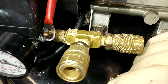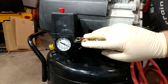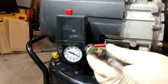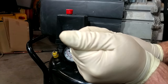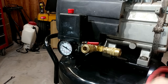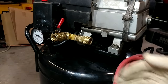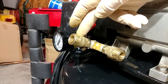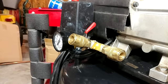If you really don't need two fittings, you don't need the T — but it's also nice to get a little more reach to your ball valve. So the first three upgrades: get rid of the junk air regulator, throw in a T fitting, and upgrade to decent fittings. I just said the fittings don't leak, and now we've got one that is a little touchy. I just had a hose in that thing for the first time in a long time, and there's probably just some crap blocking up the seals. It gives you a little more reach to operate your ball valve, which you can clearly see needs operating.